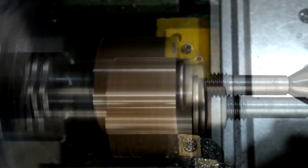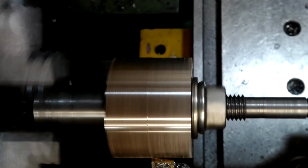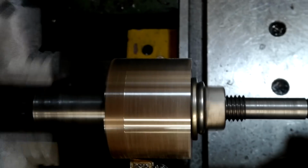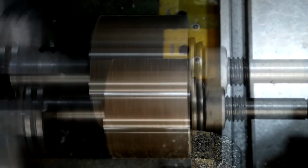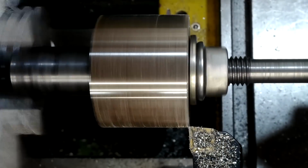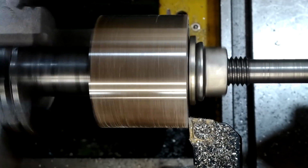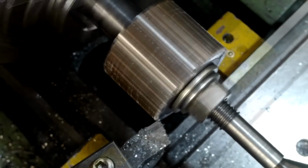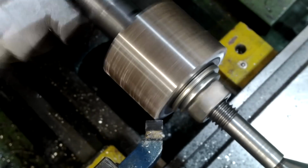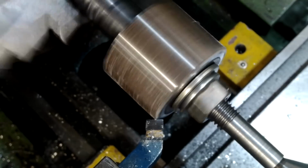With the mandrel mounted back and clocked up in the lathe, the excess material was skimmed off the outside diameter. I dressed both the front and the back faces of the now assembled roller to tidy everything up, and for good measure I first machined a 15-degree lead on each side and then touched off the edge corners with a 45-degree finishing off tool.